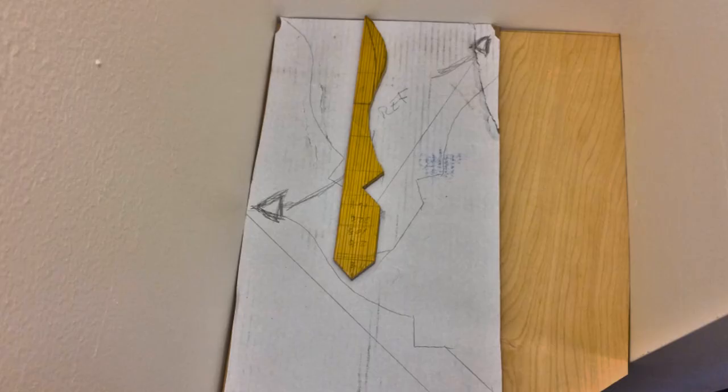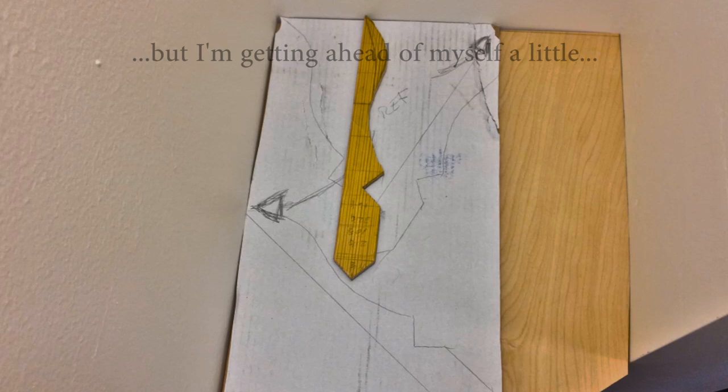What I'm going to do is place it on the cardboard with its point against the wall in various positions and trace its shape on the cardboard. My cardboard isn't square, so I've marked the two places where it touches the wall. I could have made it square, but it didn't really need to be. There will be some tweaking and finessing of the whole perimeter of the shelf anyway.